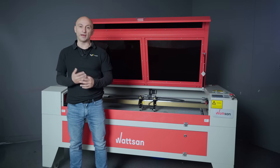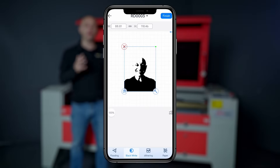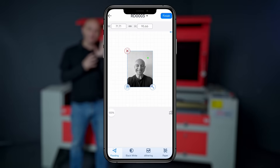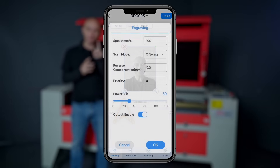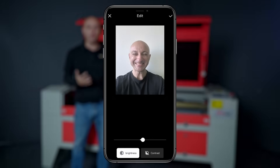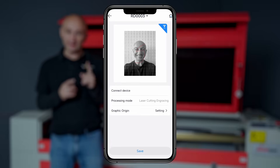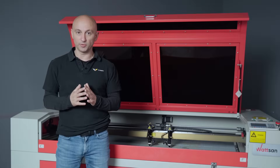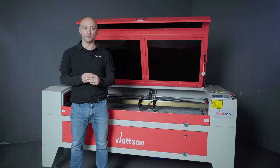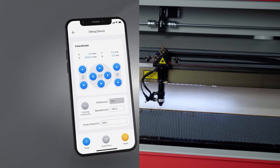Let's take a photo and try it out. We can adjust fill modes, convert it to black and white, and more. In the corner of the photo there's a flag icon — tap it to set engraving parameters: power and speed. You can also tweak brightness and DPI. Hit finish. Next, let's adjust the laser head position. You can now do this from your phone right here. Press OK to confirm and the machine will set this as the new origin point.